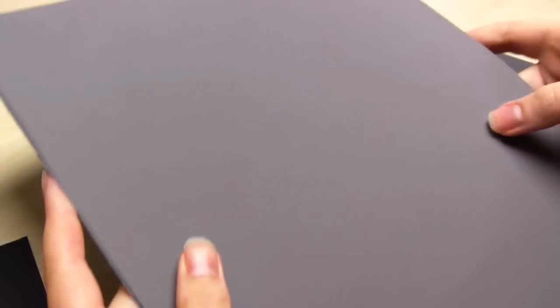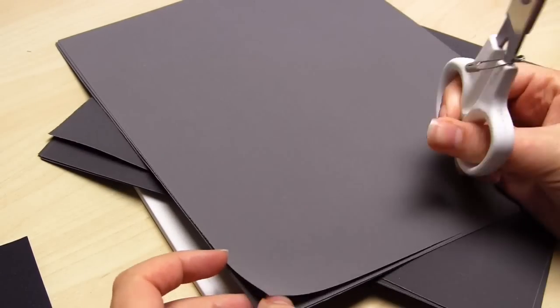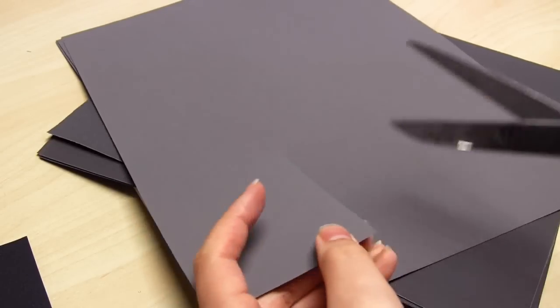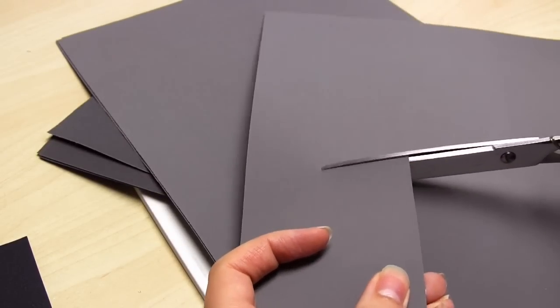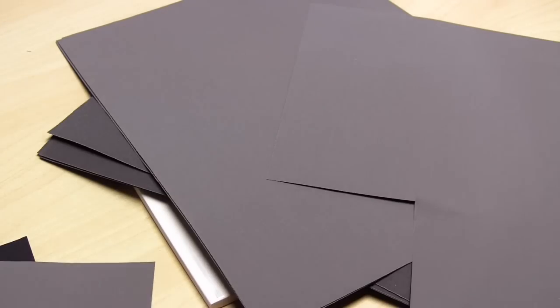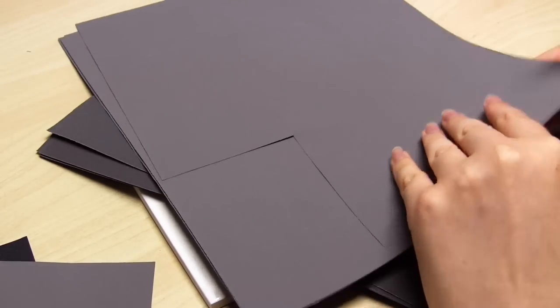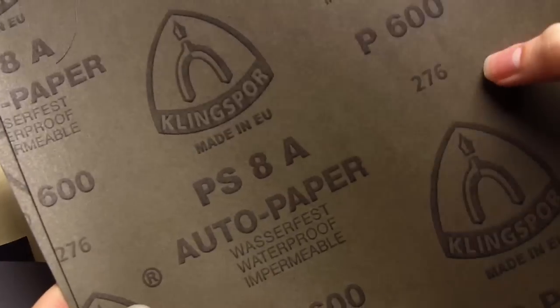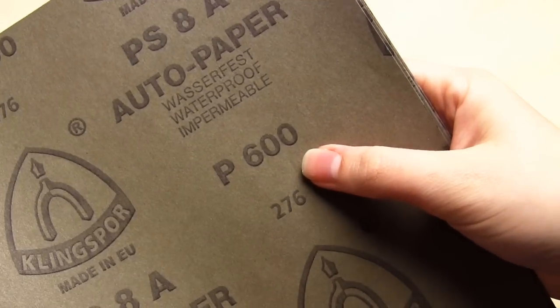When you're sanding a material, what you're basically doing is scratching that material. So with 320 grit, you're putting in larger scratches than you would with a 1200 grit paper. So even when I've finished with the 1200 grit paper, there will still be microscopic scratches in my work. However, you're not going to be able to see them with the eye, so 1200 is as high as you need to go. Sanding is best done underwater.